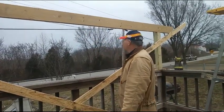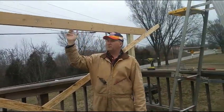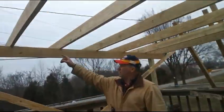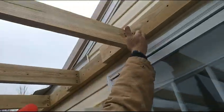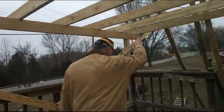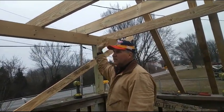We're still leaving the braces for now. When we put the first post in, we'll put one here and then one over there and check for level. We'll fasten it over there, check for level the other way, get it level, then fasten. We put one on one side, secured it, got four screws — two straight in and two at an angle. Then went to the other side, leveled it, put a screw in, and fastened from both sides. Then set the next one on top, pushed it up — four screws, two straight in and two at an angle. Leveled it, put a screw in. Now we've got this whole side level.